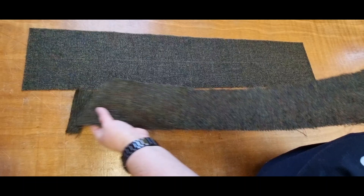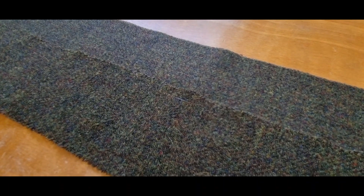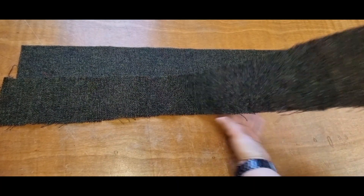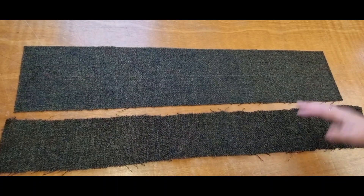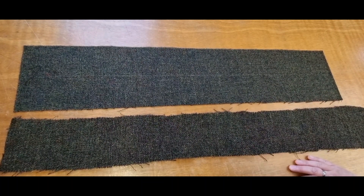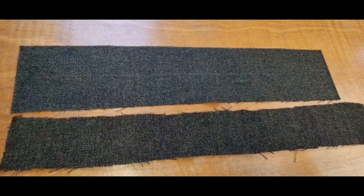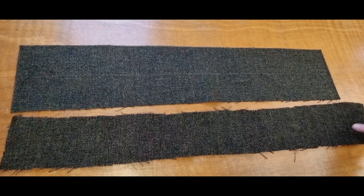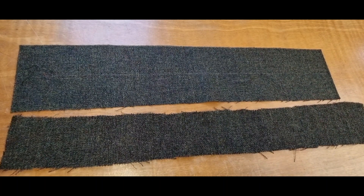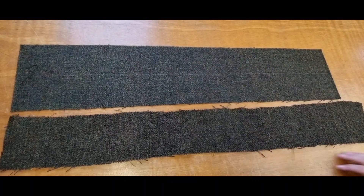There is also a colour difference. If we look here, you might be able to see the tonal differences — it's almost like this is more heavily saturated than this, and in a way it is, because this has excess dye in it. When the yarn is produced, the fleeces are dyed and then the yarn is made, and part of the finishing process is that through the wash the excess dye is taken out. So this is not only softer in feel but softer in colour as well — more toned down. And as part of the finishing process where it gets shrunk, the fibers all close up, so things on the loom in the greasy state are often more stark and the pattern more obvious, whereas it's a bit more subtle when it's been finished.